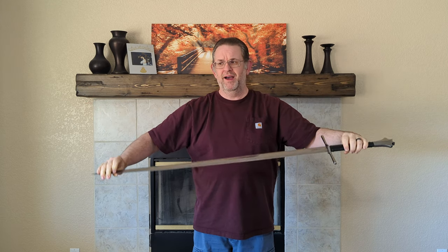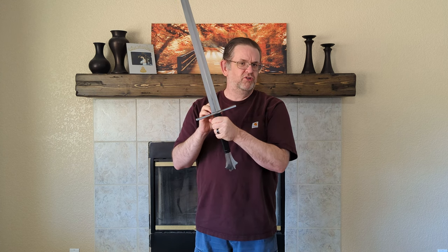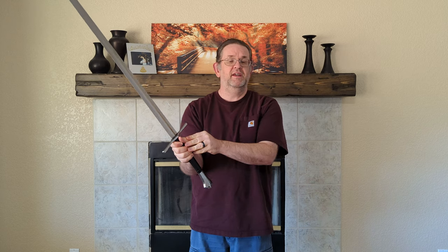This is not even full strength — this is very easy for me to flex this much. That's a little too flexible in my mind. The good thing is it does flex in the right spot — that flex starts really about two-thirds of the way up the blade, where you want it to flex. Looking at the vibration nodes, they're generally in a pretty decent spot, however it's not in a good spot in the hilt — it's more in the cross guard section rather than right where I grip it. You generally want the hilt node to be right around where your upper hand grips it, and that can create some unfortunate hand shock on bad cuts.